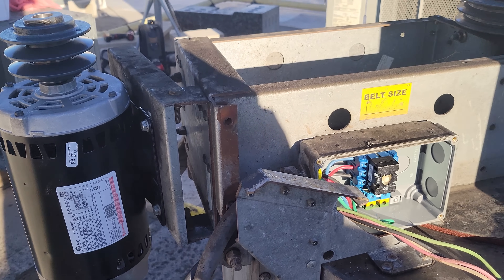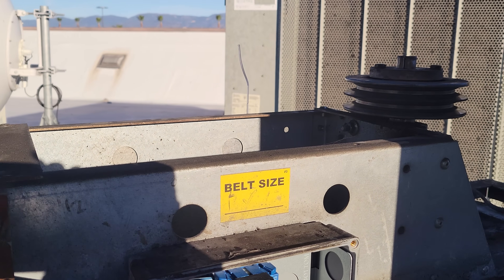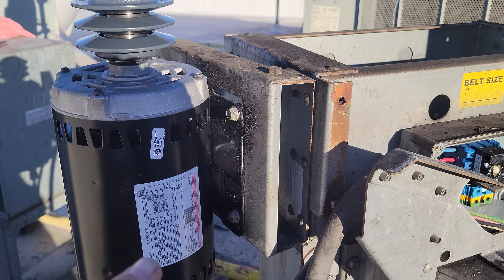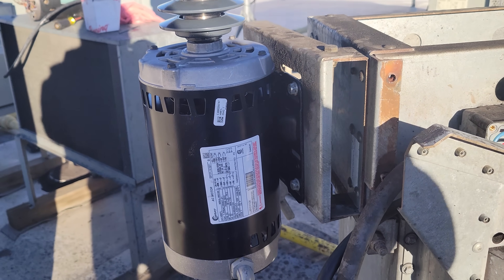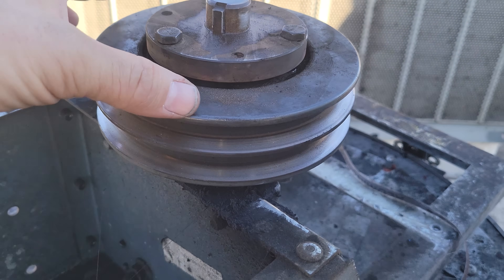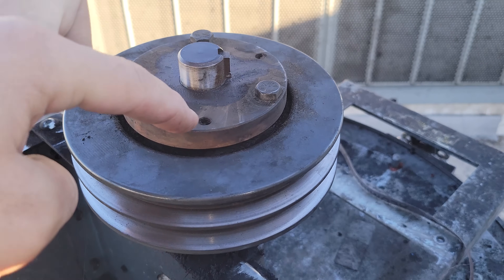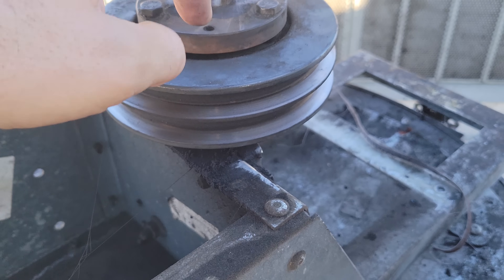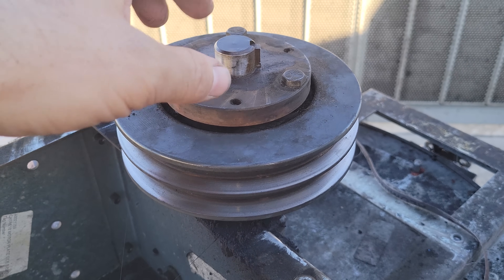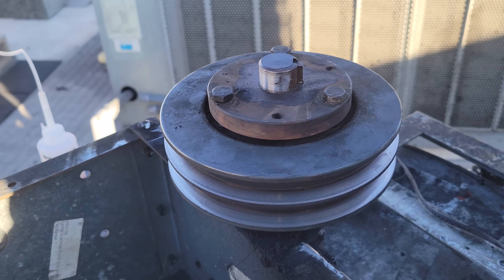This new motor is a little bit different — we mounted it and the pulley is too high. There's nothing we can do to move this pulley down; the motor is already pretty much as low as it can go in the bracket. So we're going to raise this pulley. In order to raise it, this right here is a taper. We're going to take these three bolts out, put them into the new spots here, and push to separate the two. There's a set for tightening it on and a set for loosening it, so we'll thread them down to separate the two, pull the key out, and move everything up then set it down tight.